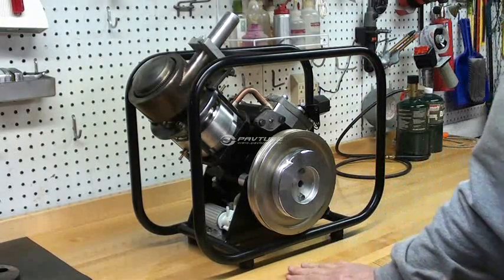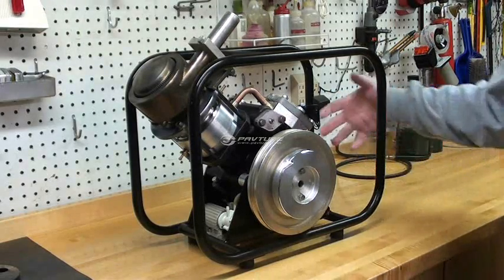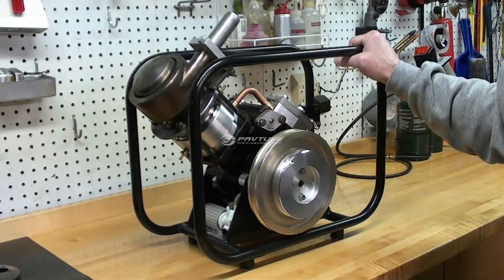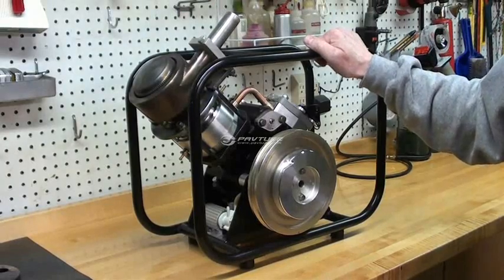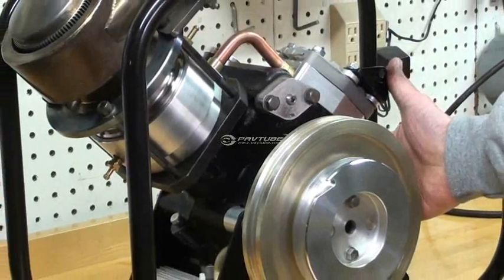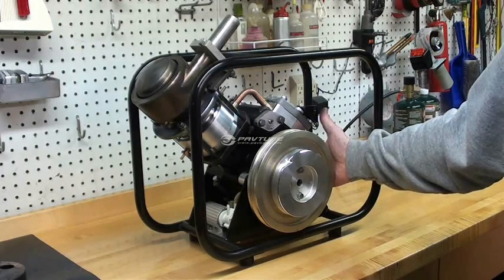The goal is to obtain about 700 watts of crankshaft power. This will be a generator set when completely finished — the engine will operate a small permanent magnet alternator, and we're hoping for about 400 to 500 watts of electrical output. Right now the engine will turn up to 1800 RPM, though that's only momentarily due to insufficient heat energy from the heater. The engine is water-cooled and oil-lubricated, using a special synthetic lubricant with a very high flash point provided by the Nye Corporation.